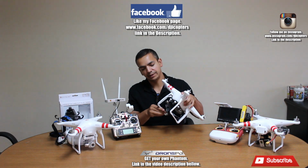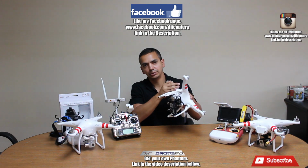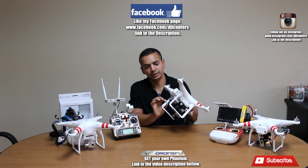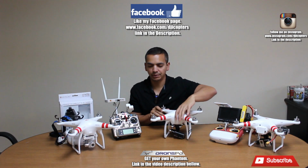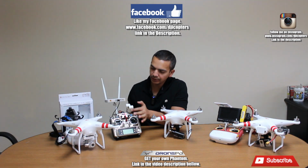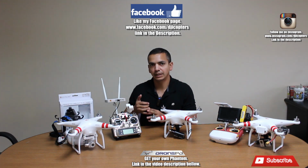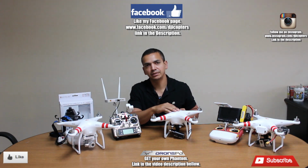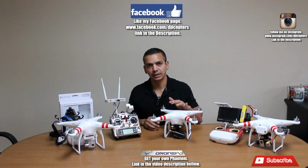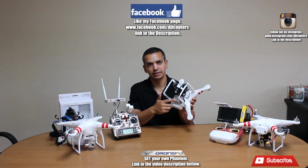You can see right here the way I have it set up for the antennas. I have the panel antennas that, in RC groups, Blade Strike told me to use because they get better range, so they're diagonal, these panel antennas, and everything has worked very well and very nicely. And this is where I put my phone, right over here, and I hook it up through the USB. So to review, this ground system takes care of the remote and takes care of the video. Inside my Phantom, I took out the remote RX, the remote receiver. So the only thing that is hooked up according to the instructions is through S-Bus here on the Lightbridge.